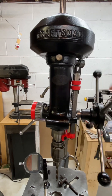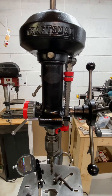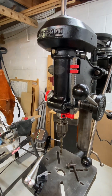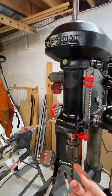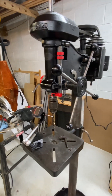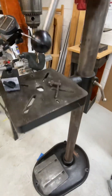The other thing I had to fix was the quill itself. The gear hitting the quill was catching every 360 degrees, which told me something was wrong with the gear. I had to file it down — I think in the last 80 years something must have given a kickback at the quill and bent one of the teeth. Beyond that, fresh paint and all the rust removed.